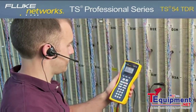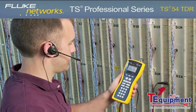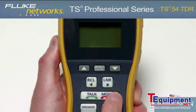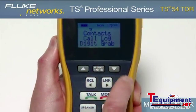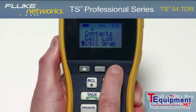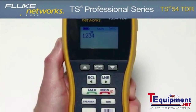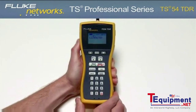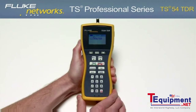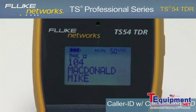The TS54 TDR features a DTMF digit grabbing mode. This is a great feature if you suspect that a customer's equipment is not generating proper DTMF signals. To enter this mode, press the Monitor key, then press the Menu Enter button twice. In this mode, your tester will display any DTMF signals generated by the customer premise equipment. Dial a number from the customer's equipment and verify the number on the display.